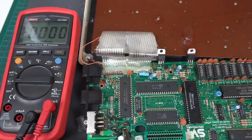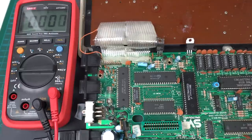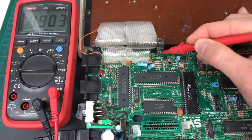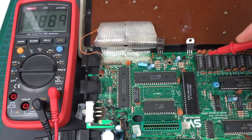Maybe we're back to where we were at the beginning. Let's test the video out. There's still something weird going on because I went to test things and I saw that I had no voltage again. So let's do some measurements. I'm going to put ground right in the plane, and yeah, it's a little low but it's okay - although it's dropping. Why is it dropping? It should be five volts here as well. And it keeps dropping. It just drops right in front of our eyes to almost nothing.